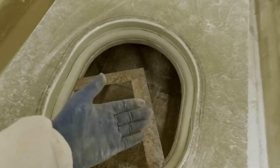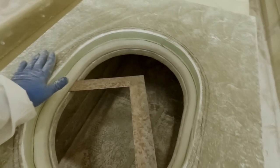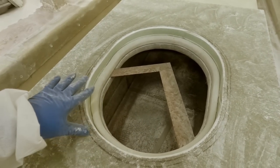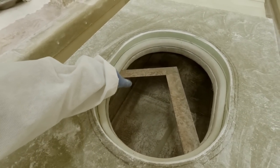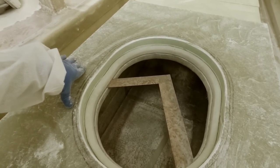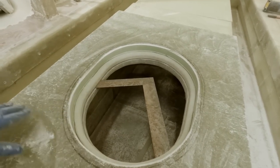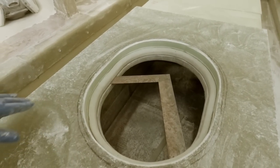And that's just an extra layer that we put in there because of the amount of force that'll be in this area. We wanted to make sure that we didn't have any issues with it sagging. If it sags or twists or anything under a load, you'd lose your seal on this and you'd end up draining the water in your fish hold into the shaft alley, which we don't want. So we're building this very strong so we don't have any issues like that.